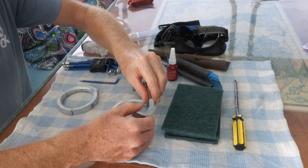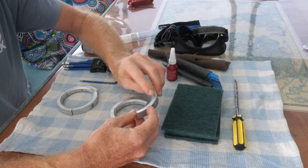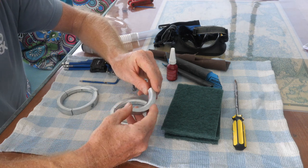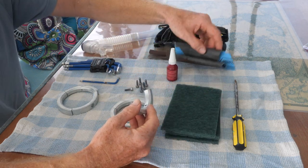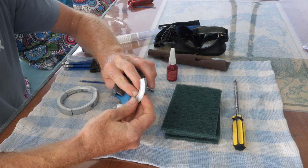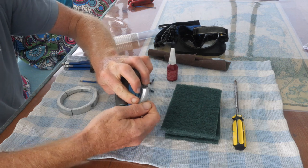Shock horror - I've just read the manual and on the zincs they also recommend you address any oxidization, as the zinc is exposed to air. They recommend that you give it a good clean either with a very rough buffer, or I'm actually just going to use some sandpaper and clean all this up so that it's fresh.